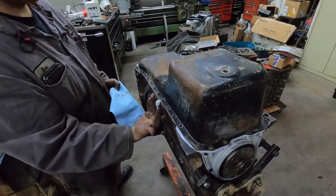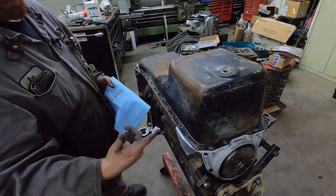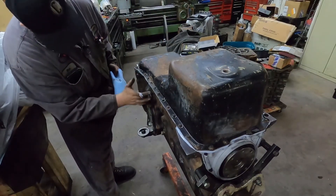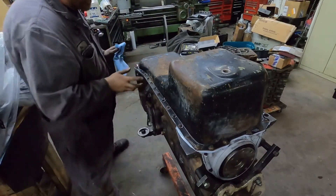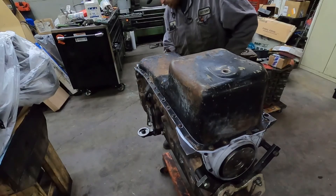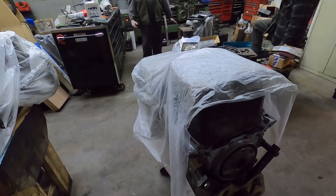Hey guys, so what I do — the reason I put the silicone this way is so it doesn't bulge out lots into the cavity of the inside of the engine. I just take my finger and run it across and smooth it out on the outside. And then afterwards, after it dries, I usually take a little bit of emery cloth or something and a razor blade and just clean up the edges and stuff, just so it looks nice. Oh, forgot to do an outro on this one — so that'll be a wrap for this one. We just got a little bit more to do, but we'll get to that on the next one. Like, subscribe — got any questions or comments, hit me down below. Thanks for watching, catch you on the next one.